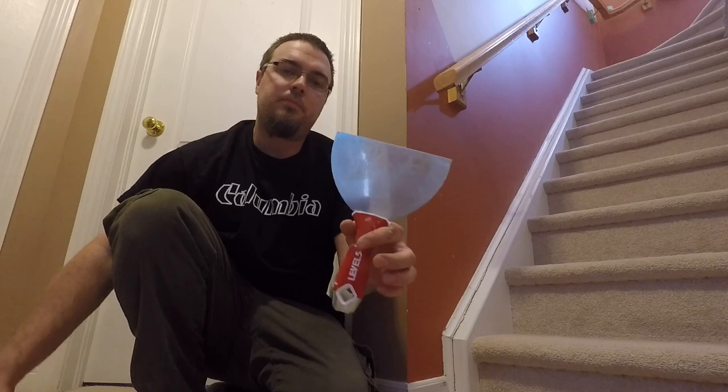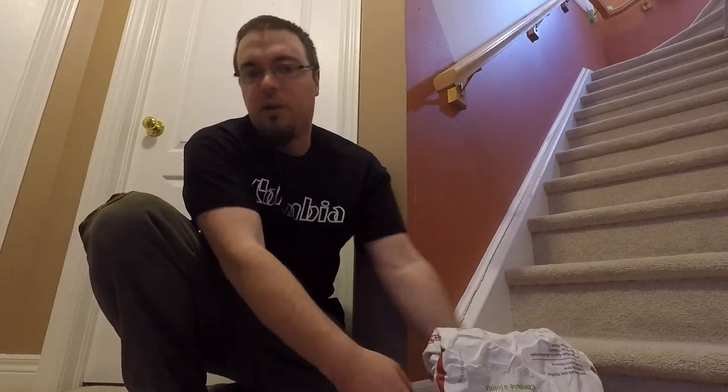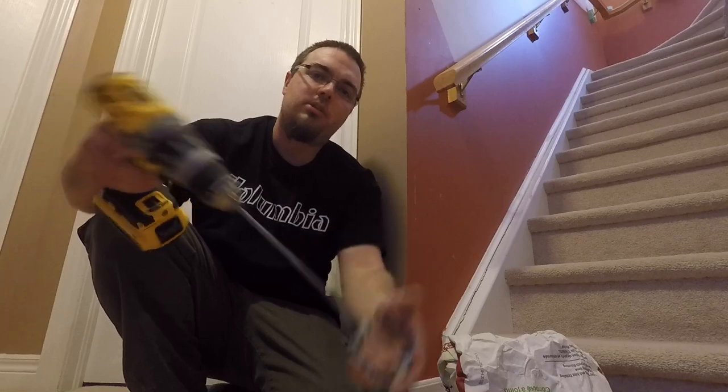Now I'm going to show you what tools and products you're going to need to do this. I'm going to be using a Milwaukee crown stapler — you don't have to use the battery powered stapler, you can use a manual or electric one — fiber mesh tape, a 6-inch knife, an 8-inch knife, a mud pan, and some sheetrock or hot mud. I'm going to be using sheetrock 20 because it dries faster, especially on painted surfaces, where anything you put on will take at least double or triple the time to dry if there's no fan on it. To mix up the sheetrock I'm going to be using the Advanced Equipment mini mixer on a DeWalt drill.